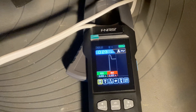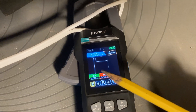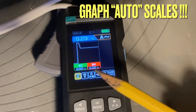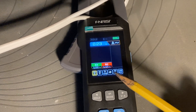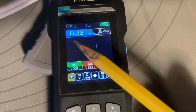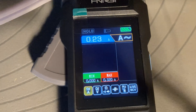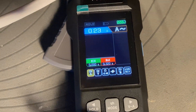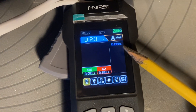I'll have to speak over the fan — it's going to be a bit loud, but you'll have to tolerate that. Pretty much as you'd expect: we've got an inrush current, a maximum current draw of about 320 milliamps, and it keeps that in memory. The current current flow is 230 milliamps. So let's hit the save button — and it actually records it here. That's just the fan current, stabilized at 230 milliamps of AC current.